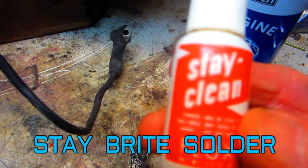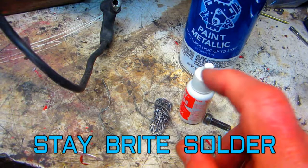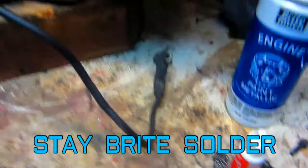I'm going to grind it now. I want to show everybody — anybody who doesn't know about Stay Bright: the name of this solder is Stay Bright, you can buy it in any hobby shop. This is what I used to make gas tanks for model planes with. This solder melts at a much lower temperature — it's 410 degrees, not 700 — so it's for a job like this. We're going to try it; maybe it won't even work, but we're going to try it.